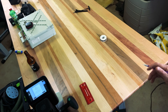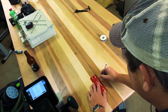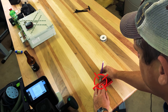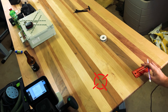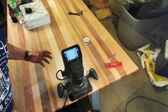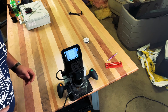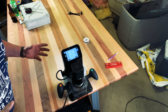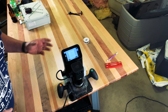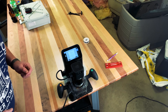One of the first things I always do when starting a cut is to mark the centerline of where I want my design to be. I'll take my straight edge and mark a crosshair on the wood. Once that's in place, I can move on. The next thing I always do before making any cuts is to center my router base approximately where the cuts are going to be made, to get an idea of where to place my shaper tape.